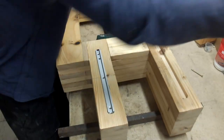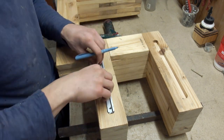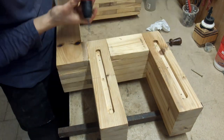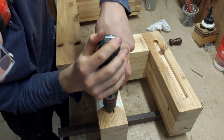These will be the rails for the upper wheel assembly to move in. You have to make it adjustable — the upper wheel has to be able to move down to release the tension when you want to change the blade, and to move back up when you want to cut again.